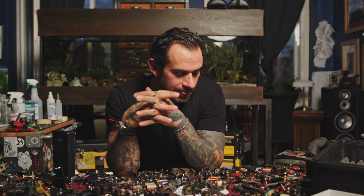A compressor was expensive because you had to buy a specific one, a dentist one, the silent one, made already for dental clinics. That would be the best one you could get on the market, in different sizes and different prices, obviously. If you want one machine only, you need a compressor which runs constantly, because you have to supply air to the machine all the time, or you have to have a big compressor with a big tank, so the compressor would switch on at certain periods of time. So it wasn't so easy.